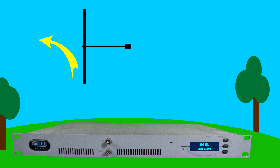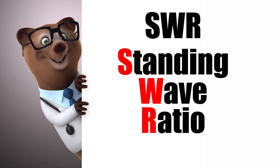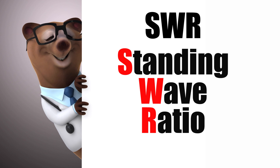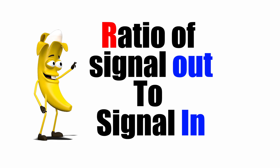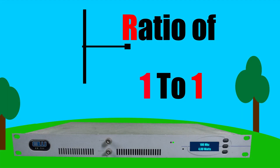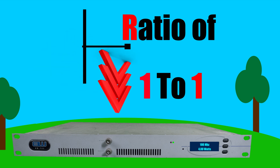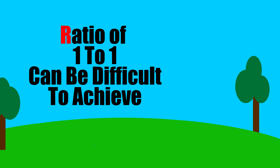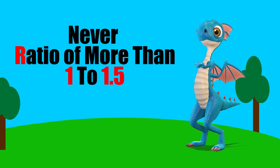What you want is to have the maximum power going out the antenna and as little as possible coming back. The term SWR means standing wave ratio, which has a very technical explanation, but the simple explanation is that it's a ratio between the power of the transmitter signal and the signal coming back from your antenna. In theory, a 1-to-1 ratio means all of the signal is going out and nothing is coming back. This would be the perfect scenario. It can sometimes be difficult to achieve exactly 1-to-1, so the aim is to get as close to 1-to-1 as possible. Never leave it above 1-to-1.5 though.